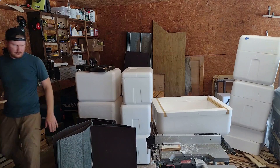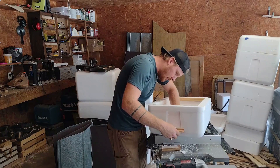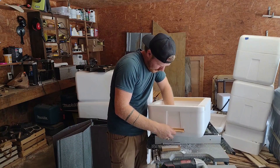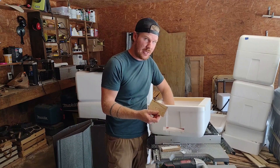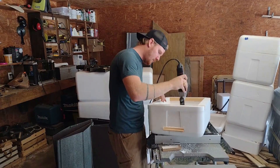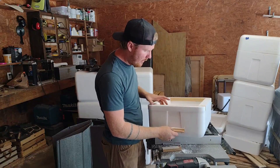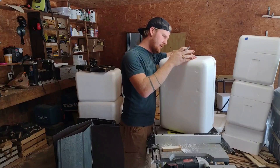I've got my front porch piece. I'm putting it in just to make sure it fits and I got my cut right, so I can know where to cut next. I'm going to take my oscillating multi-tool again and cut out a notch for this porch to sit in, so that way the porch is flush with the inside floor. I cut it to the depth of the porch, then drew a little guide line so I can cut the front away to fit the porch.